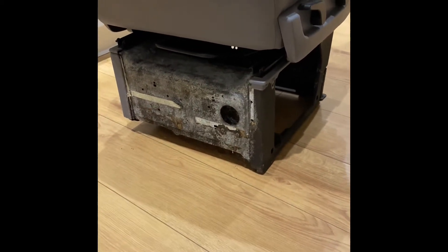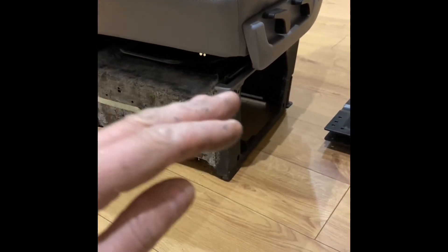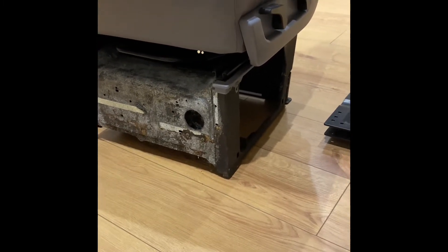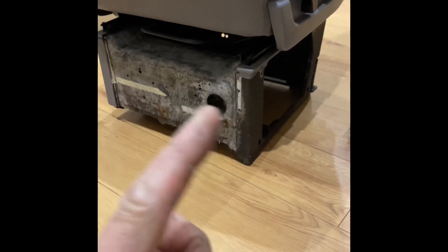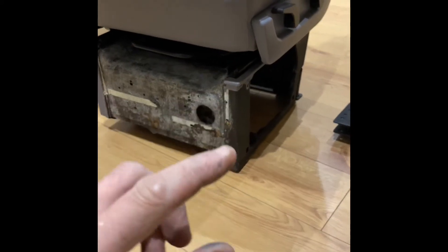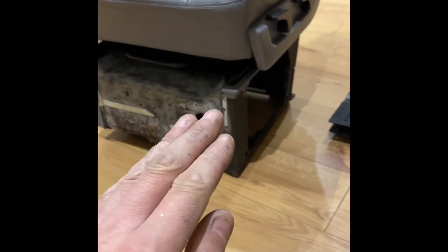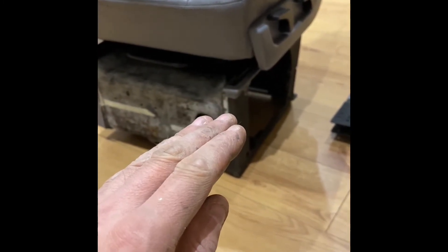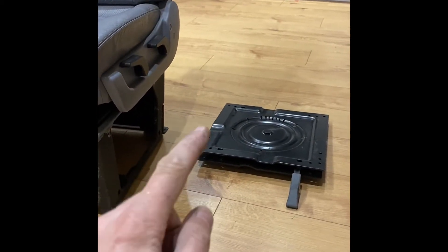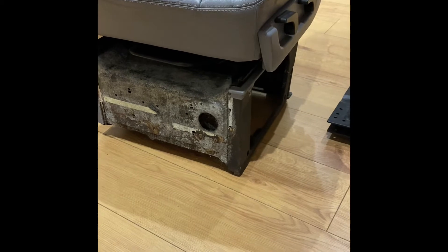I've had a think about it for probably an hour or two, taking this off and putting it on top, looking at how it can fit in various different scenarios. I've decided what I'm going to do is modify the base - cut this down, drop it, and put some plates in to fit the base inside the top, creating a new level that sits a little bit lower than it is now, then make some brackets for the top of the sides to match the positions for the rails under the seat.